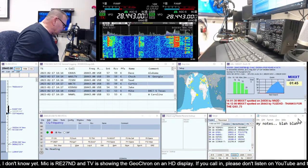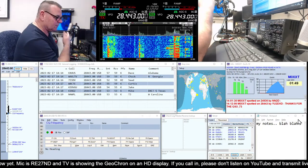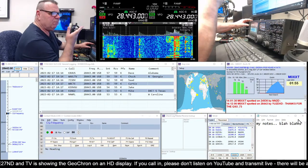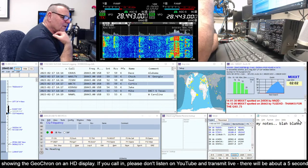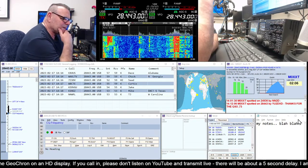Heavens alive. What we were driving, 14 watts then on 10 metres, so that'd be about 600 out. Well, I'll tell you, actually, what were we getting? 450. And there's a couple of dB loss by the time we get on 10 metres. I'll listen back to the stream, actually, and see what it was like.